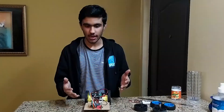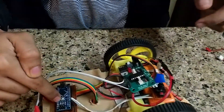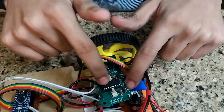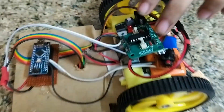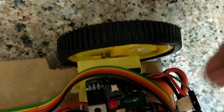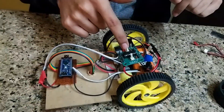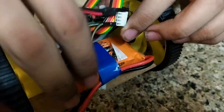This is my project, the Line Follower. So this is the brain — the Arduino Nano. Another main component is the motor driver, the L293D motor driver. Here is a 7805 IC, a voltage regulator, to convert 11.1V from the battery into 5V. Down here is the battery — this is a 3-cell LiPo battery, 11.1V, 1000mA.